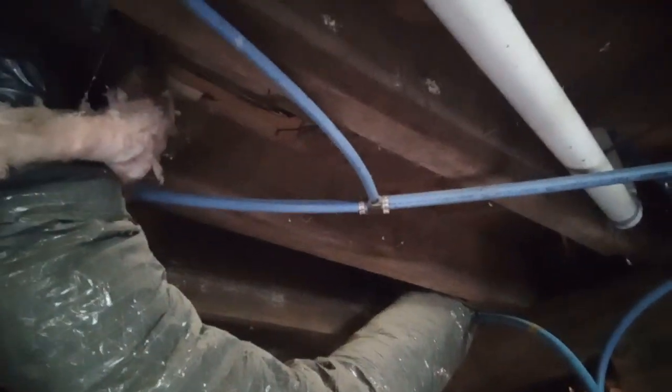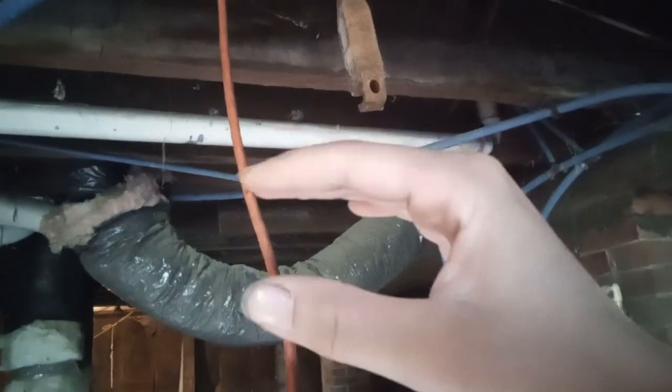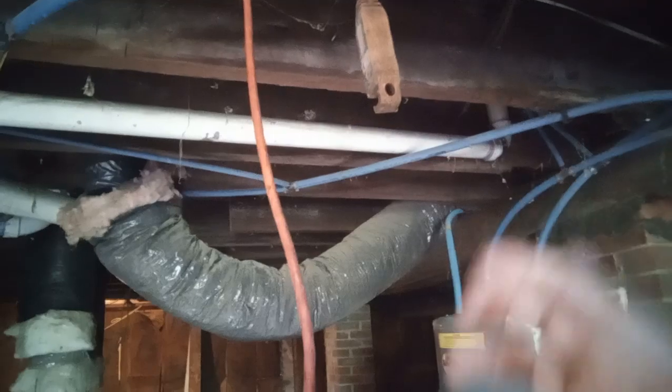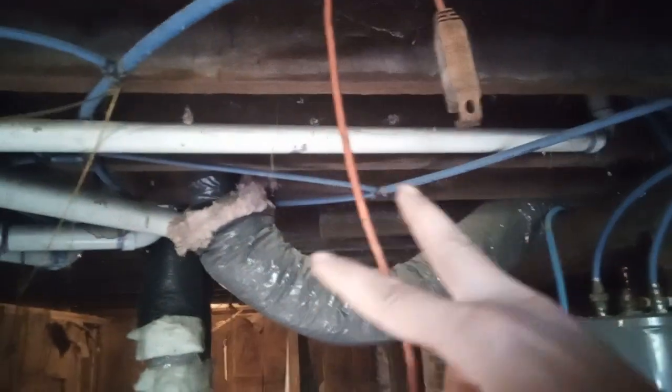Unlike a spring check valve, a swing gate check valve has to go in the right way — whereas a spring check valve you can plumb any which way and it's fine. It's gonna be a swing gate check valve and it's gonna be great because it's gonna have a third port up above and a drain on it.